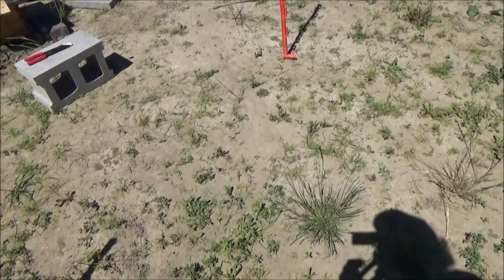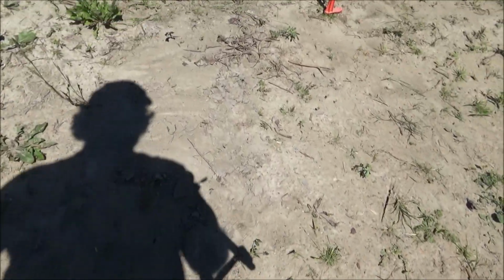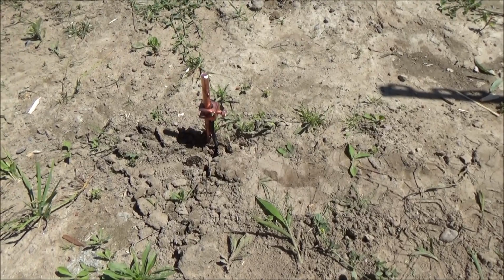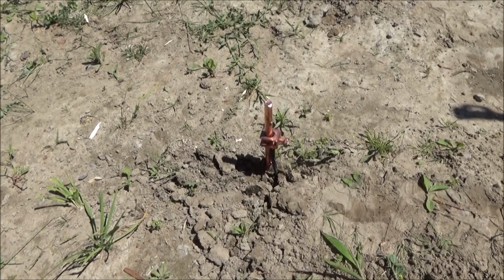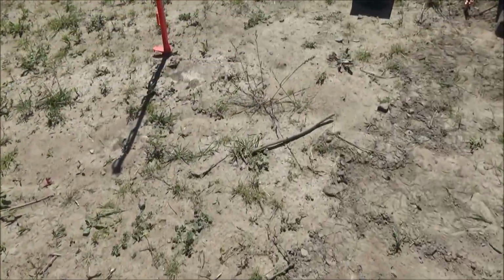Okay, so next step for me was to bury and connect the ground cable. And you can just see the line here that I've done. I used a double shielded underground rated cable to be able to bury it. You can use copper, obviously. That's probably the best, although I'm not sure if copper is usable for underground, but buried it all, connected this.